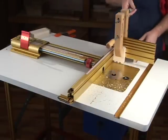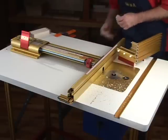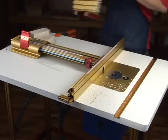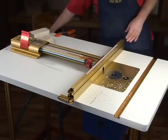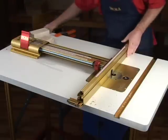This completes the tail cuts. Now for the pin boards. The pin cuts are made with the stock face down on the router table. Move the LS to the first pin cut that positions the cutter outside the fence, 6B in this example.